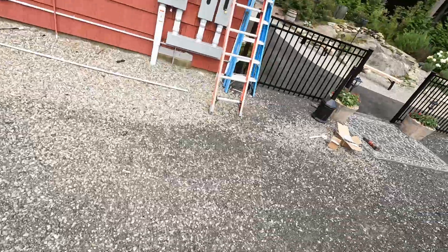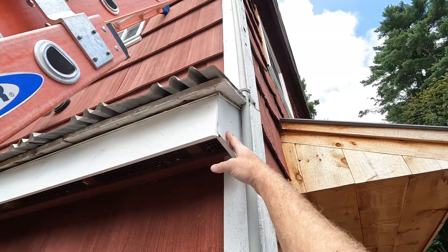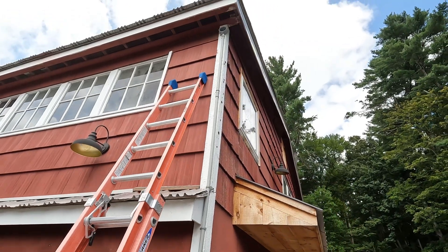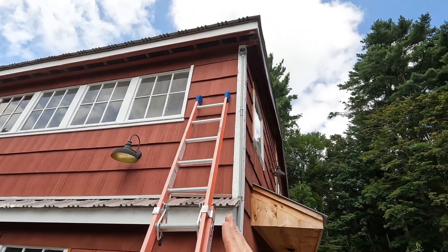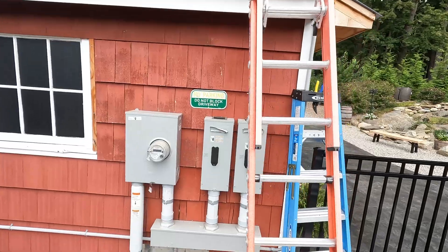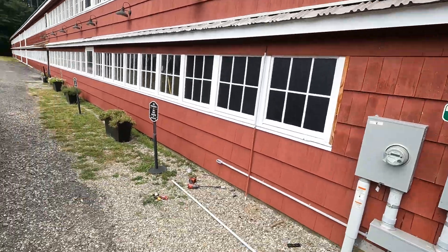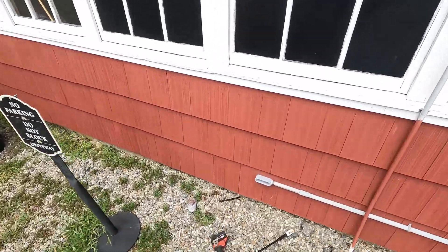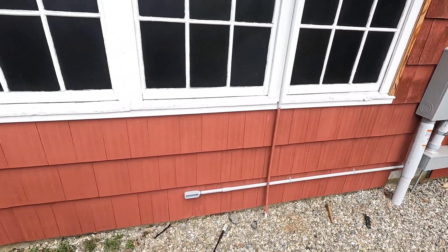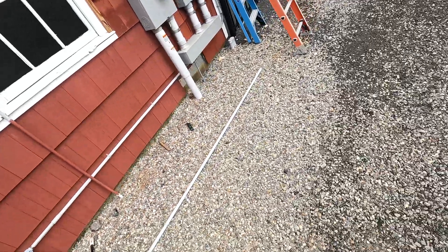Here she is. I had to kind of make the best of a tough situation. I obviously couldn't cut this, so we notched just this section to go up. There's a slight bow that I don't love, but it was either the J-box at the top hanging off by two inches, which I hated, or a slight bow. They are going to paint all this conduit to match — this upright will be white, the side section will be red — so I think it'll be fine once it's painted, but it probably drives me crazy.